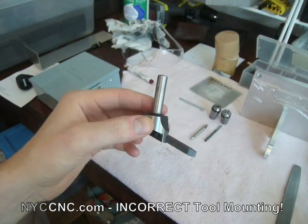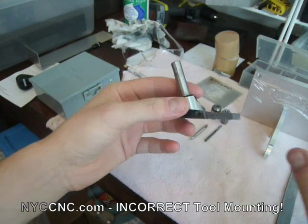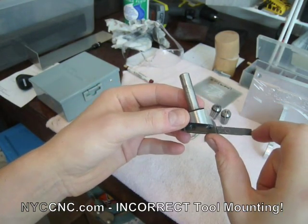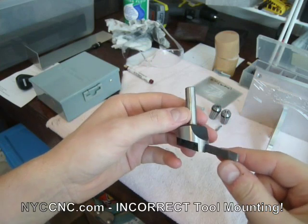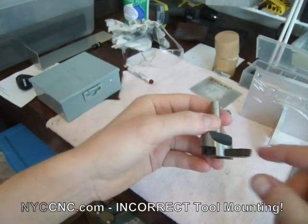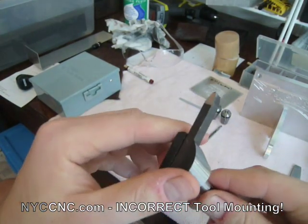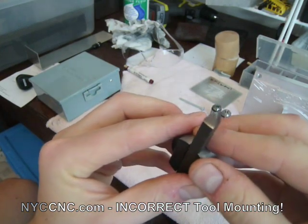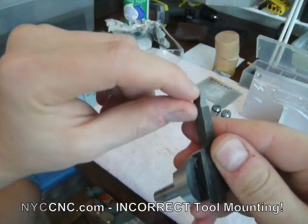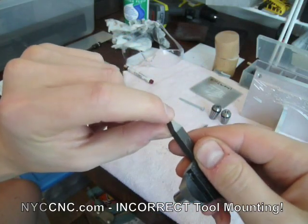Here's the fly cutter I'm using. This fits in my 3/8 inch collet and the current setting here is about a 2.4 inch diameter, which I didn't think I'd be able to pull off on the machine given its rigidity, but it did work. I also just wanted to note that after about a half hour or so of cutting, you can just barely see it has started to wear off the radius and flatten it a little bit on the tip there.